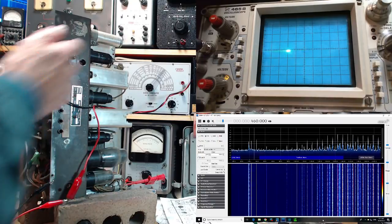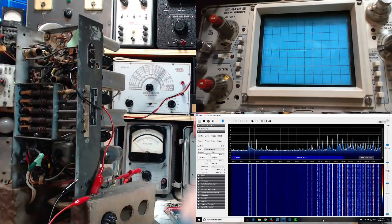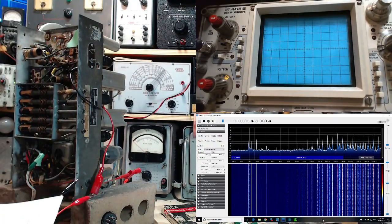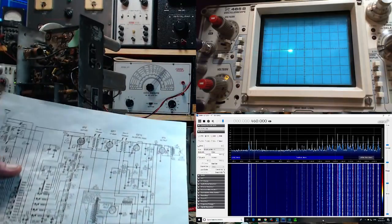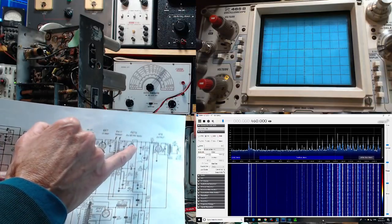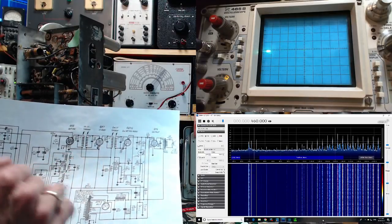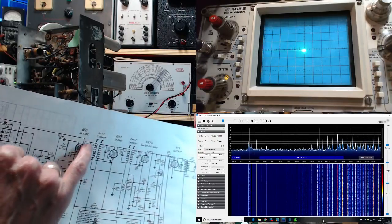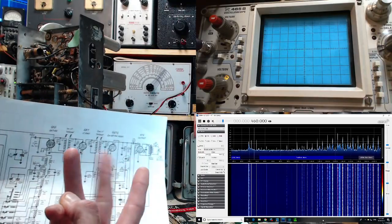I hadn't done this too. Another thing that's a bit of a mystery for some of you and for me is how it is that I can, on the SDR in the lower right corner there — the radio's not on yet by the way — hook up a piece of equipment here and apparently see what's coming out down here. And I don't think that's the case at all. I mean, that's not really possible, is it? But certainly when I hook up the SDR at this point — this is the plate of the mixer tube going into the first IF — we get three interesting things to look at on the SDR.